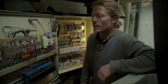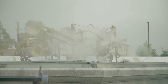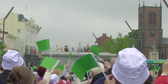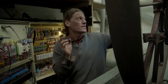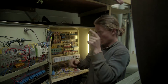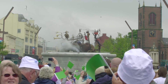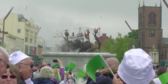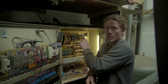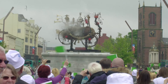Here are the electronic and electrical controls. Basically, numerous switches, inputs and outputs, that time when each switch turns on and off. More importantly, it's got switches and sensors everywhere. For example, it starts with the lid open command, which tells the contactor to turn on the big hydraulic power pack. Once the lid's opened, it hits a little switch at the end that signals back — only once it receives confirmation that step is done can it proceed to the next. And so it goes on and on.